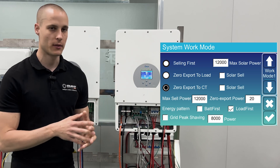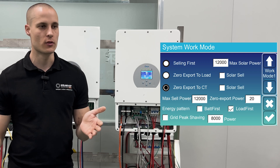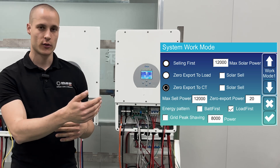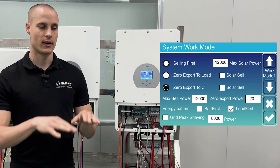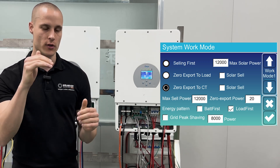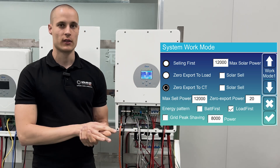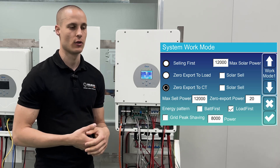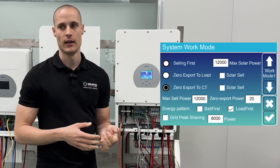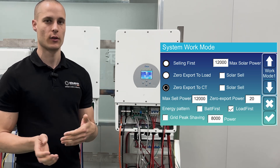On the consumption side, this can be set up to a maximum of 500 watts, so that if power demands change rapidly, we always draw 500 watts from the grid. This gives the inverter enough time to adjust and compensate for fluctuations, preventing any unintentional momentary feed-in when consumption suddenly drops. By default, this is set to 20 watts and the manufacturer doesn't recommend changing that, as they design and optimize the system around this setting.